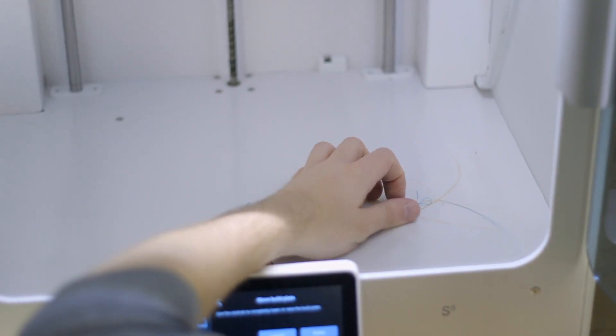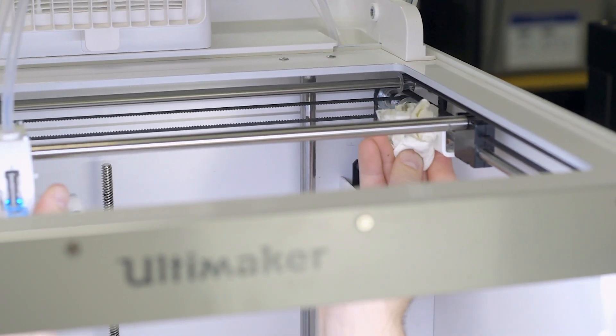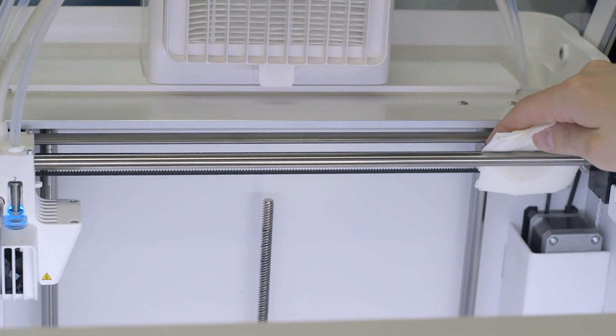Ultimaker 3D printers don't have a lot of moving parts, so maintenance with these machines is quick and easy if you stay regular with it. Remove debris from the chamber and dust off any of the surfaces. Pay special attention to any of the moving parts like the gantry rods or the Z-axis rods, and check for any loose filament caught in them. Once the area is clear, use a paper towel with some isopropyl alcohol to wipe down every steel rod that moves the gantry — all 8 of them.